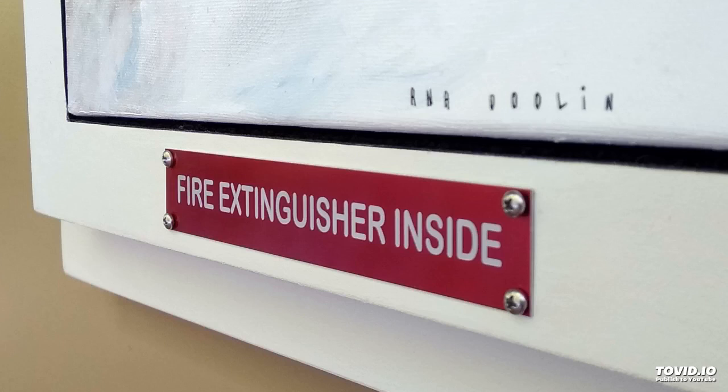If there's anything else in the way, protruding from the other side of the wall, you will have to remove that too. If you followed my directions, you checked for something on the other side of the wall. It's important that you check the warnings in the instructions and do that before you make that cut in the wall, because if it's something that can't be moved, then you will have to replace that panel.